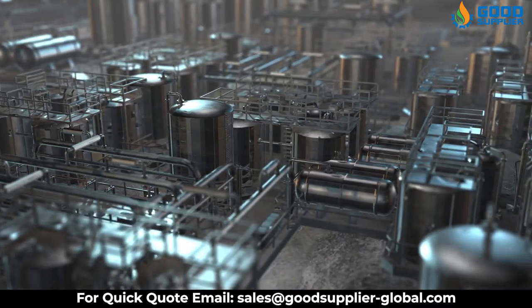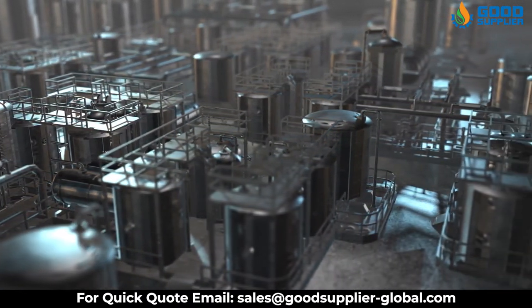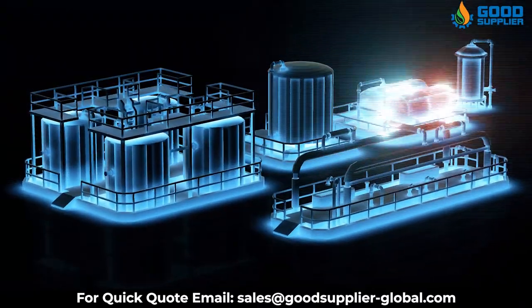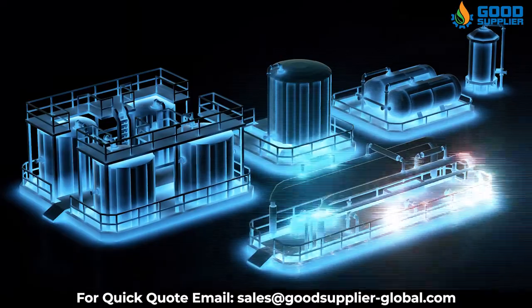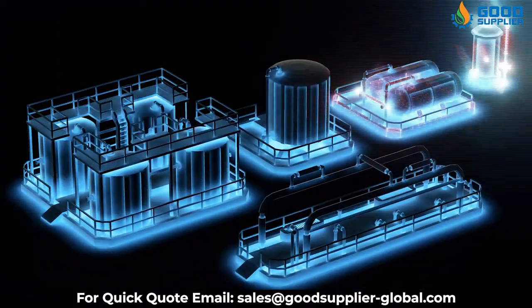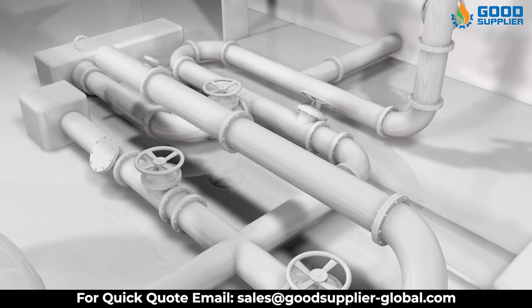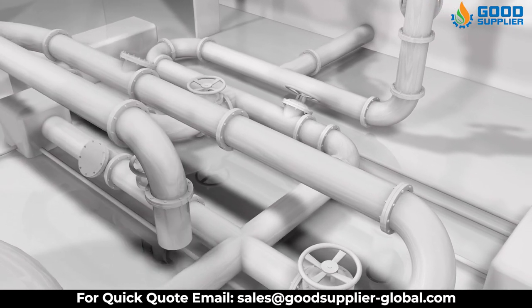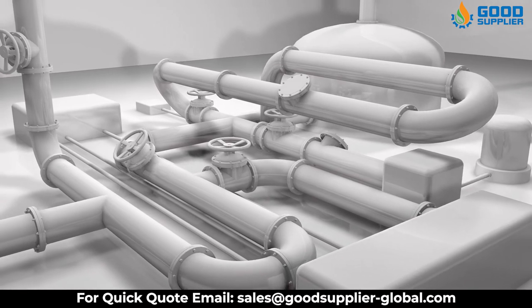Cameron's chokes are used in high CO2 and H2S, high chloride and high temperature environments, and employ modern corrosion resistant alloys (CRAs) to provide trouble-free service life. Low alloy steel bodies are lined with nickel alloy 625 in a weld cladding process, providing a thick, impervious layer of the CRA bonded to the base material.